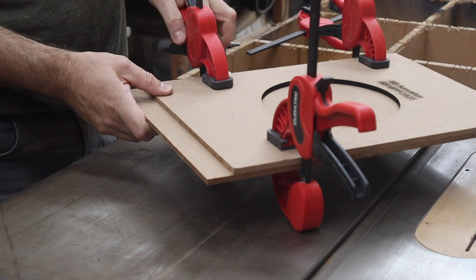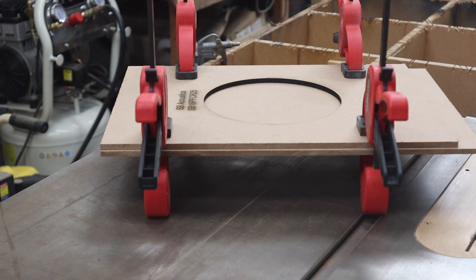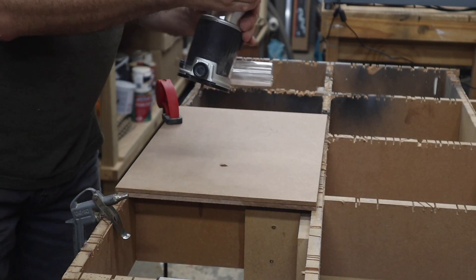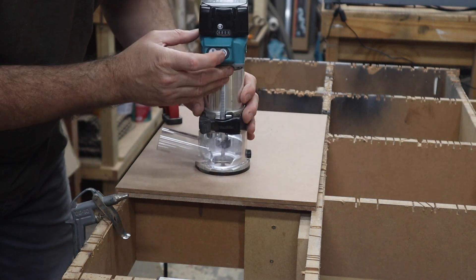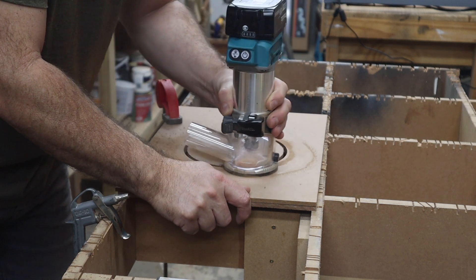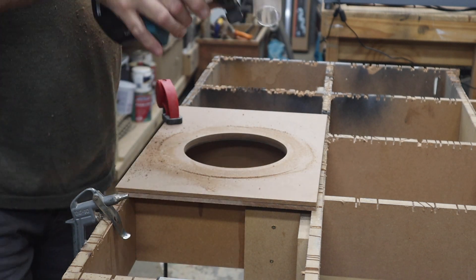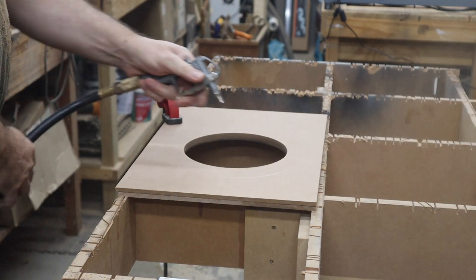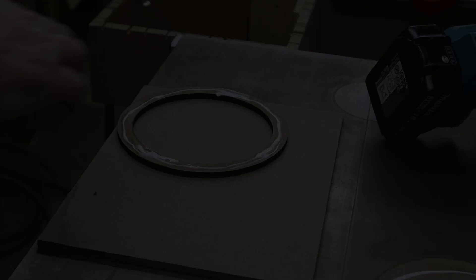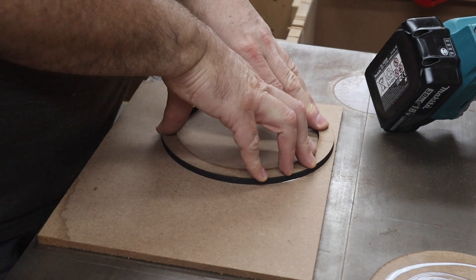To increase the thickness of the template I glue another piece of 6mm MDF to the parts that I cut with the laser, then use the trim router with a flush cut bit to cut the excess. The trim router I'm using is from Banggood and is very similar to a Makita trim router — it fits all the Makita accessories and 18-volt batteries. I've been using it for a while and it's very good quality. I'm also using a spiral flush trim bit from Banggood and that also performs really above my expectations. I'll leave purchase links in the description box below.